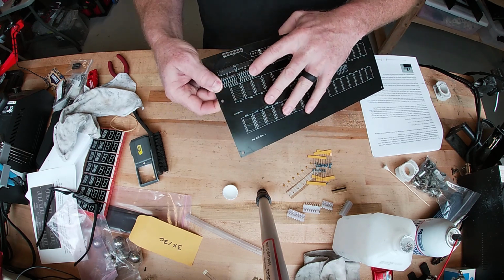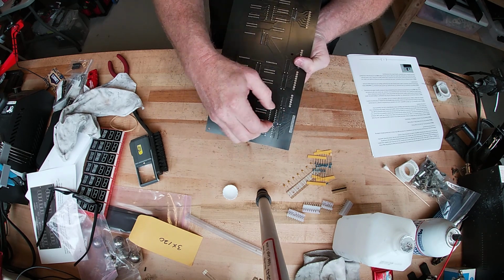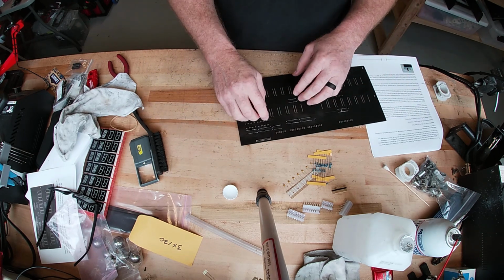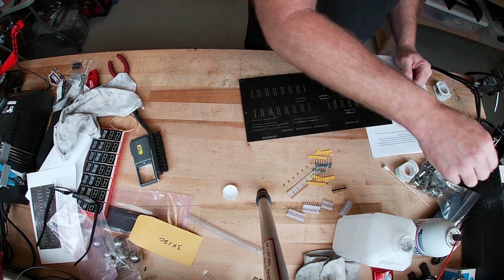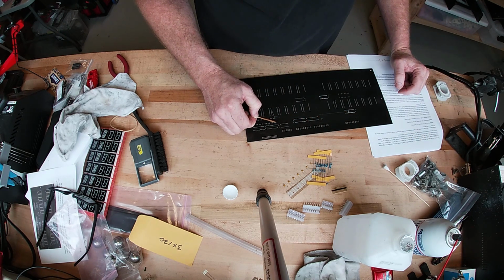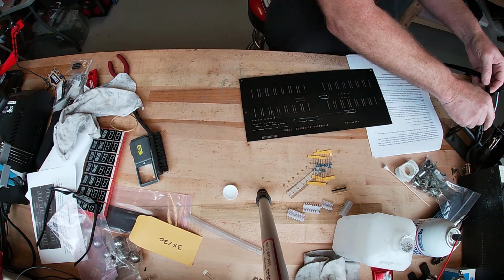All right, once it's up against the board, you can take the leads and bend them out slightly, and that way when you turn the board upside down, it doesn't fall. And then just solder each one from this side of the board. Put just a little bit of flux on there. Like I said, you can do the whole line of flux at once before you start this.